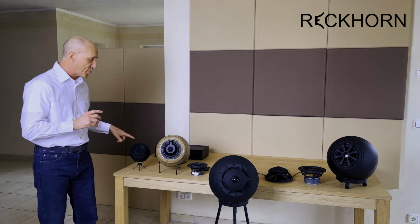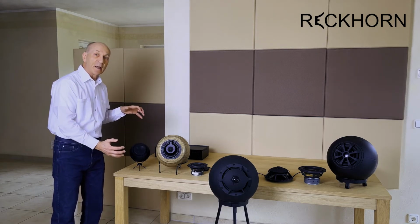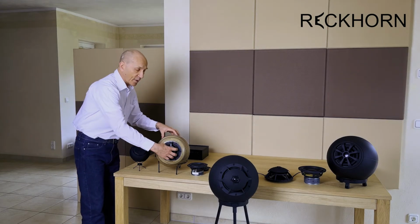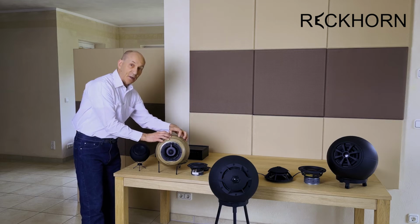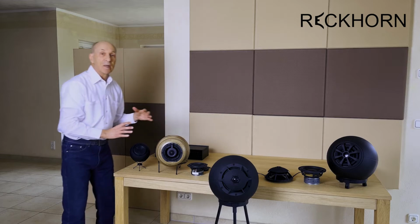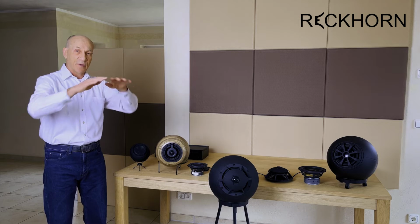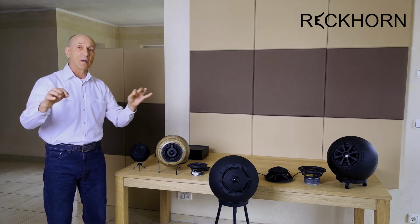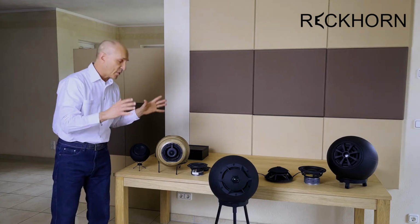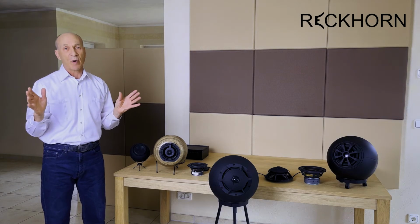Compared to these, the speakers have a double problem. It's not only having a pressure in this direction but also in that direction, because whatever the cone is moving has an effect on the housing. When the cone goes in, the housing wants to go out. When the cone goes out, the housing wants to go in. Then you can try to handle this problem if you have a square box, to reinforce the inner walls from each other. Lots of measurements are needed to get rid of this problem. We don't want to have this problem.